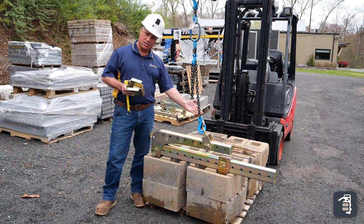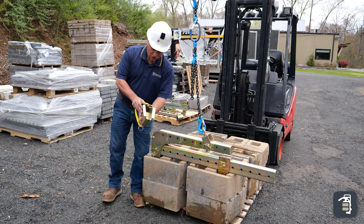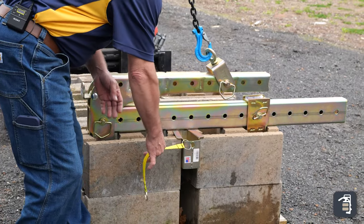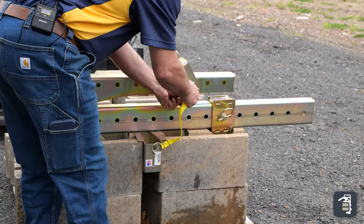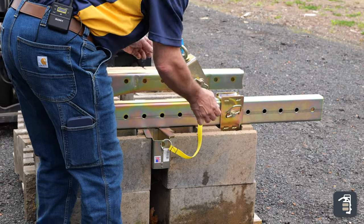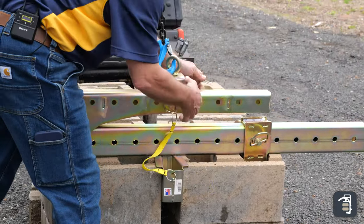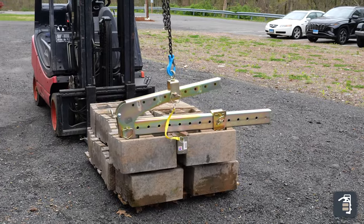This particular pallet is stacked with faces together, leaving a gap in the back. We've created a wedge — this product goes right in the back. It has a little lanyard that hooks onto the clamp so it stays attached during the building process. Once I'm in the cores and centered, I double-check it and I'm ready to start slinging block.